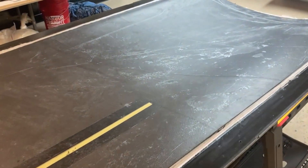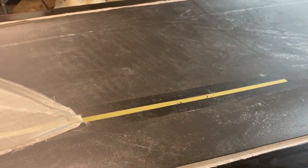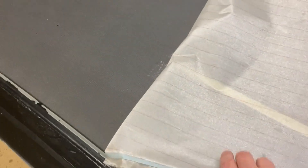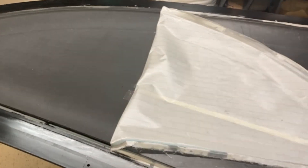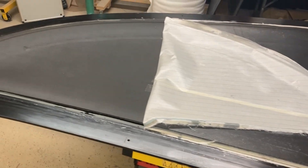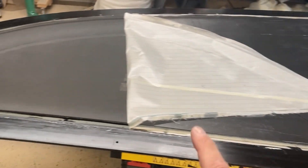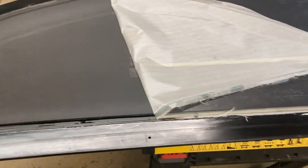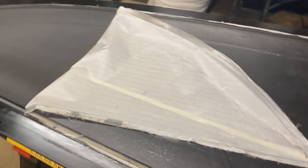It's the next morning and everything cured up nicely. I've got all the consumables pulled off with the exception of the peel ply. This is what the peel ply surface looks like before you pull it, and here you can see I'm starting to pull it — that's what the surface looks like. You've got to be a little careful — if you yank the peel ply up you could demold the skin. I really want the skin still stuck in there until I add the core, so that the shape doesn't get compromised.